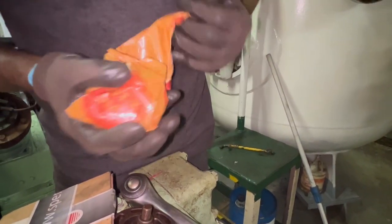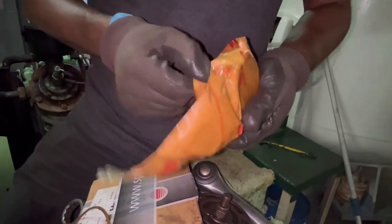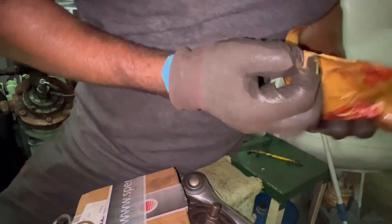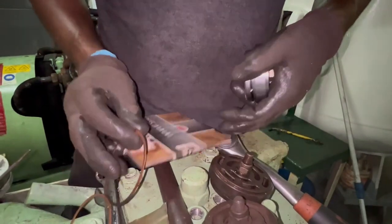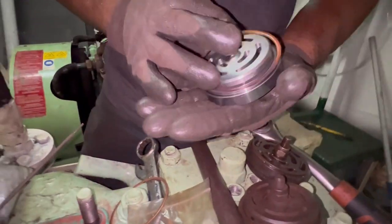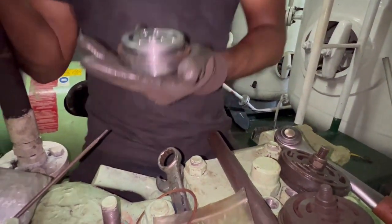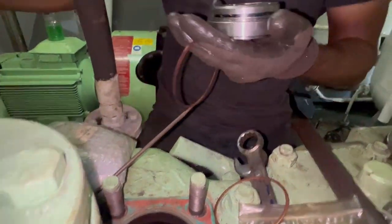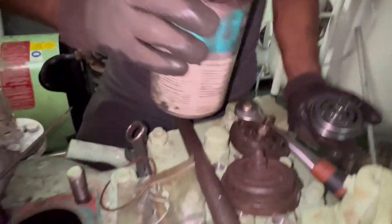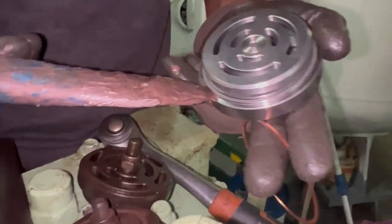Double-check to ensure everything is correct. This is the new valve. When doing the replacement of both suction and discharge valves, there are chances of mismatching — putting suction in discharge and discharge in suction — which will give wrong readings. To avoid that, do one valve at a time.